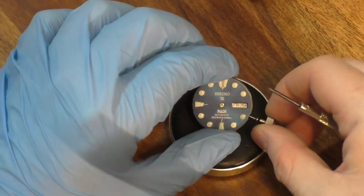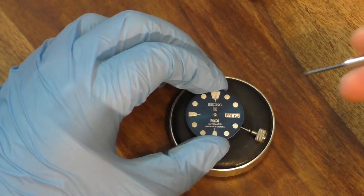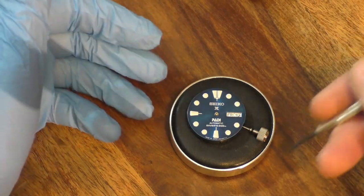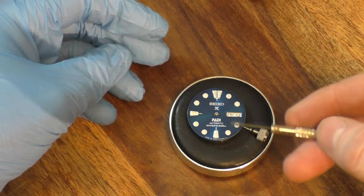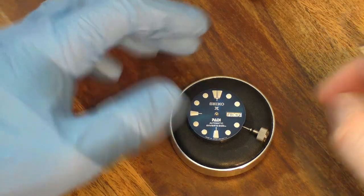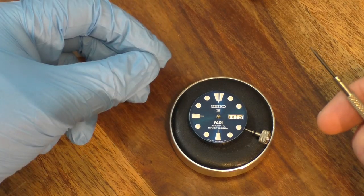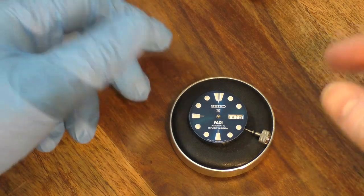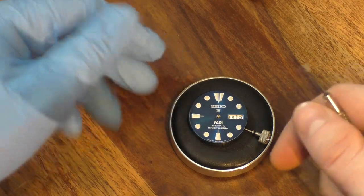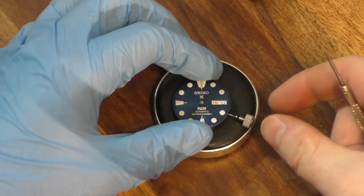Because this is coming out of a watch with the crown at a quarter-to-four position, and the dial only has two sets of feet — one at each corner. If you get an aftermarket or mod dial, you'll find it comes with four feet so it can fit either a three o'clock or four o'clock crowned case. If you want to put one of those dials into a three o'clock case, just cut the feet off and use some thin double-sided tape or a semi-rubbery adhesive to position and adhere the dial to the movement holder. With this one, it's just a case of swapping one out for the other and the dial feet line up perfectly.